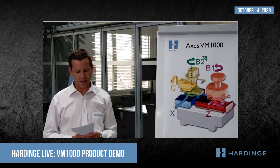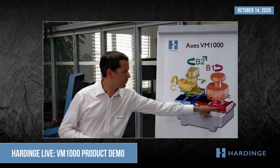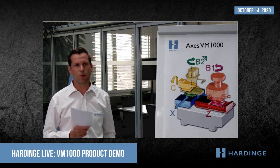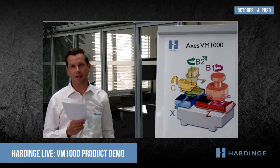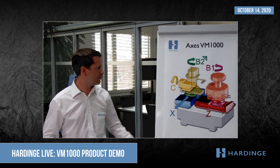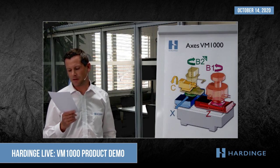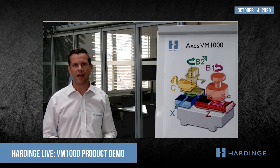Two hydrostatic linear axes called Hydroline are mounted on a machine bed. A hydrostatic B axis is mounted on the Z axis, which rotates the wheel head. The second B axis is mounted on the X axis, which rotates the workpiece carrier. We would like to go into more detail about the components. Michael will now explain the Hydroline axis.